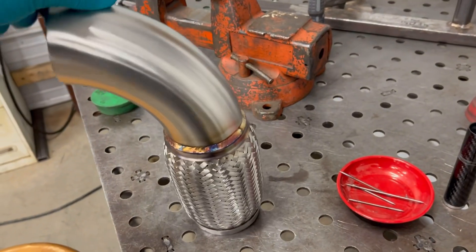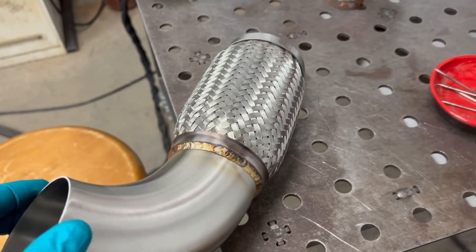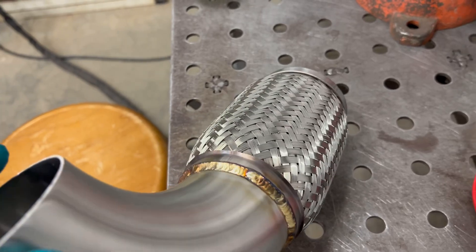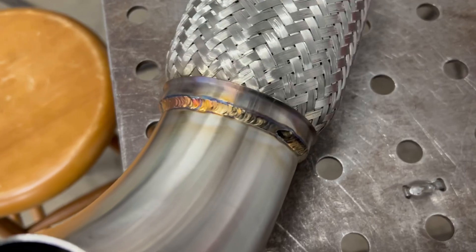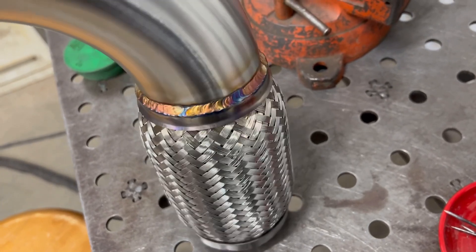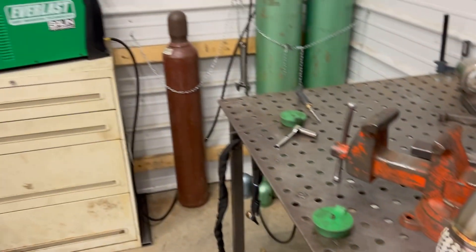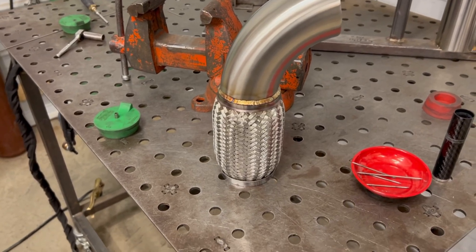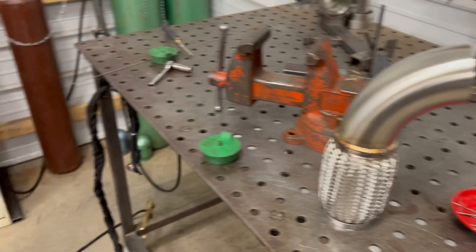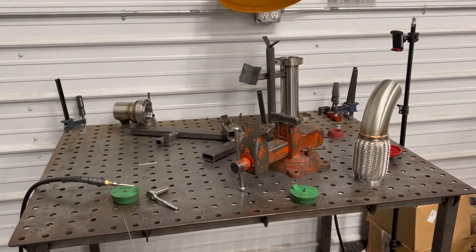I'm not a guy who enjoys welding flex sections just because of the layers. I could have taken some breaks to keep the heat and color out of it, but it's a downpipe — it's going to change colors anyway. The Typhoon is so easy to control. The control benefit of the arc is right up there with the buttery smoothness — it is night and day. I'm not a professional; I do this on the side, maybe 10 to 30 hours a week. The arc control is just so confidence-inspiring — just plowing right through these flexes that have several layers, which has always been a challenge for me. It's honestly like cheating compared to the 210 EXT.